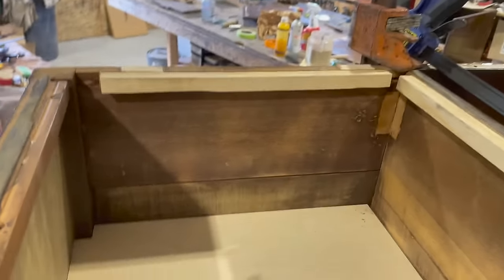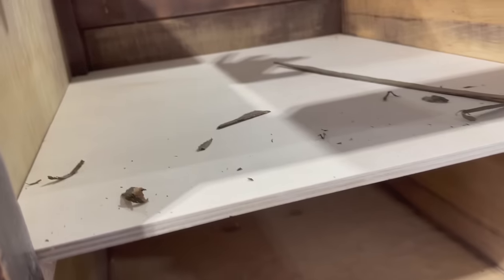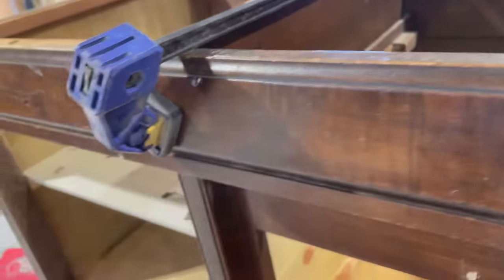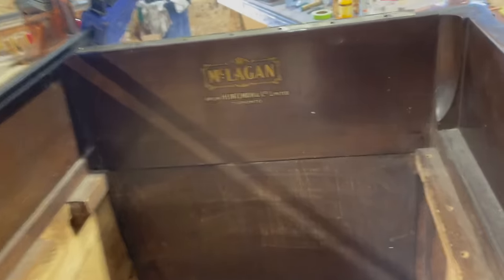All right, so I've got one shelf in here. Let's do a little notch out for here. Just using a 1/2 inch ply. And on this side, I've got another one cut to go in. And I'm only using 1/8 inch ply on this side because it's got pretty big hangers here, so I don't have to worry about that. You don't see the front edge of this shelf, so don't need to use 1/2 inch ply,